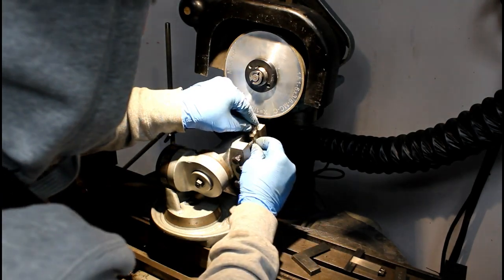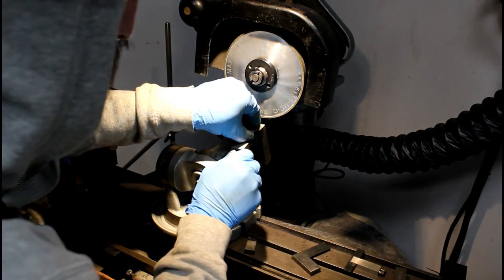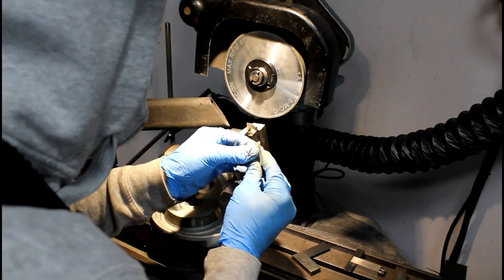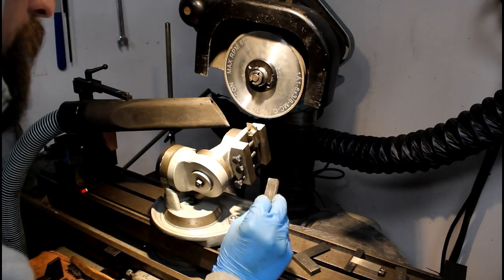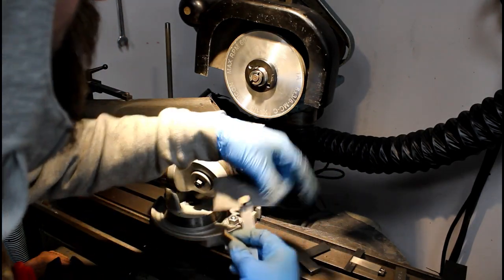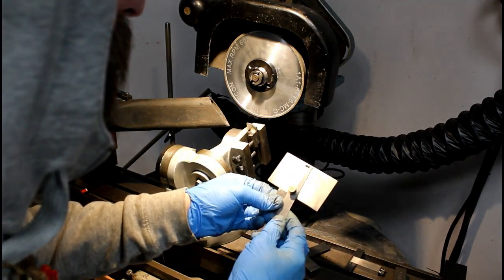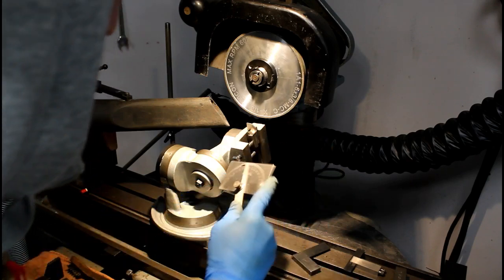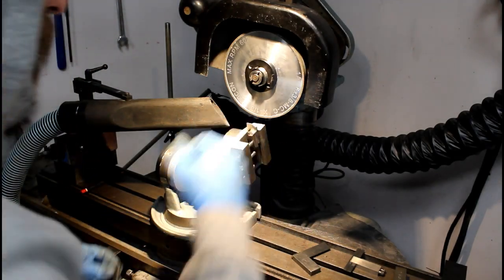And all I did to measure the angles that are in that insert, this original, which I'm going to replace even though it doesn't appear to be broken, simply because it probably has some cracks in it, is this little protractor. So I just measured my angles. This is close as they need to be. And then dialed them in my fixture. So this shouldn't take long, a few minutes.